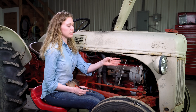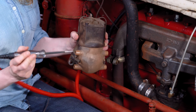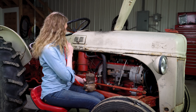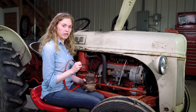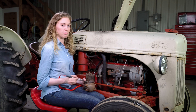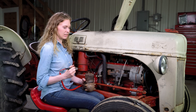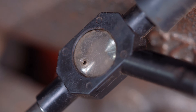Then I want to test the distributor. This front distributor is inside the front of your tractor. I'm going to touch my tool to the post at the top of the coil on my distributor. When I touch it, I'm going to touch the starter button on the tractor to roll it over. If everything in my distributor is working properly, this light will flash on and off. If it stays solid, then I know that my points are not working. If it flashes, then I know everything's working in the distributor and I still don't have spark — my next test would be to use a spark analyzer between a spark plug and a spark plug wire to make sure I'm getting good spark there.